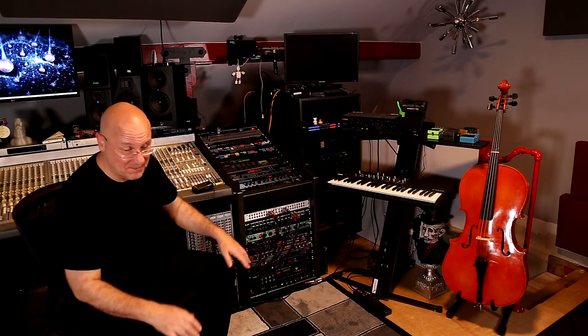You're probably wondering what those little Cylon things are that are blinking back and forth. I got them for about 20 bucks — they're basically rack-mounted power strips, but they accept an audio input. I thought $20 for a rack-mounted power strip, that's great, and I'll get a little light show with them. They're a little annoying — those blues are really bright — but I'm going to use them anyway just because they're fun. I have a headphone splitter that comes out of the console, and these have ins and outs for the audio signal, so it goes out of a spare headphone output and I've got it chained to all of these. So when I'm running music through the console, these things hear it.